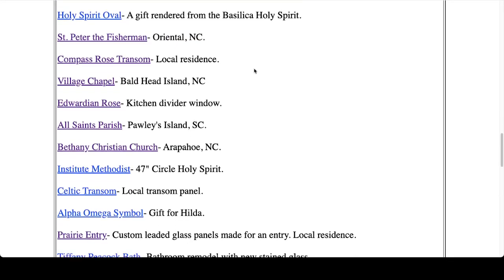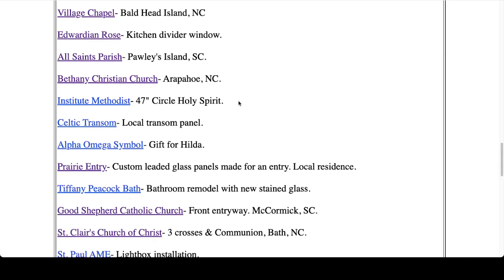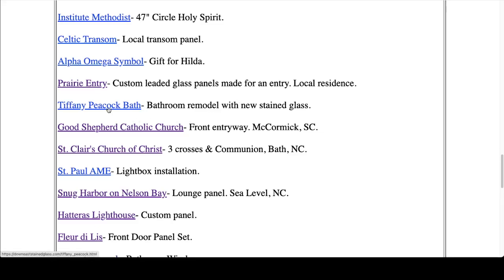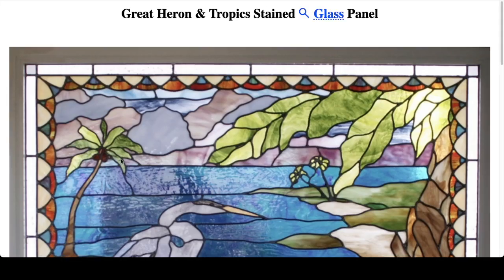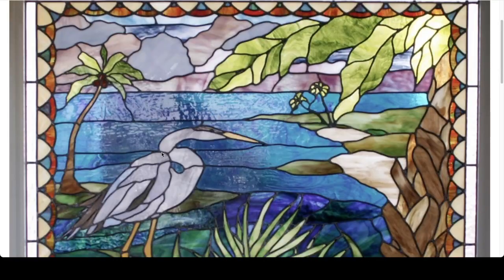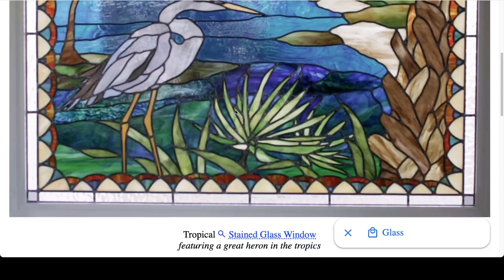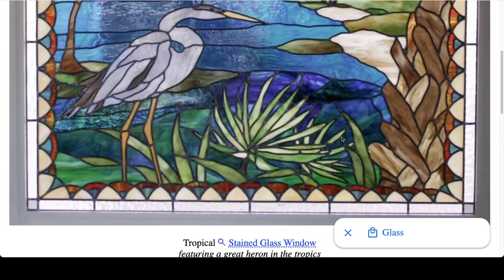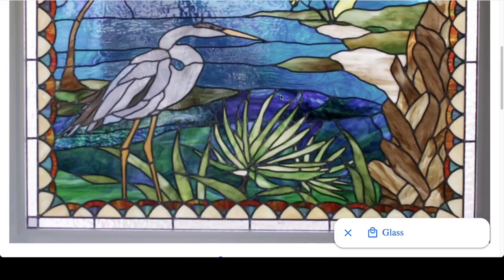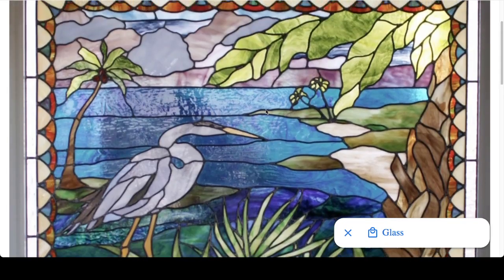So, like I said, a lot of my windows were done with the hard lead, the high tensile. And then where I had to use, that was broken. See this one here, another leaded glass window. This one, actually, the whole thing, I used the regular lead. I didn't use any hard lead here, the high tensile lead, because there's just too much freeform detail, and a lot of the mitering was not easy. I mean, the mitering is not hard to do.